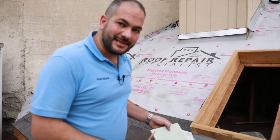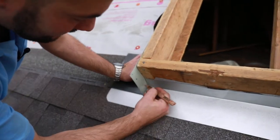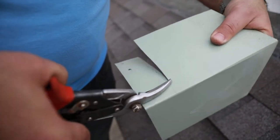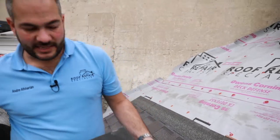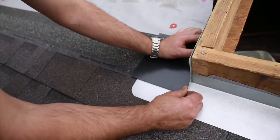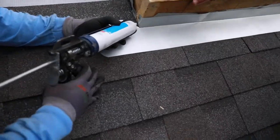The first piece of tin shingle we want to fabricate slightly to improve the flow of water. You want to bring it down past this shingle's nailing tab, make a mark, and cut it down. As always, we want to round off these corners for aesthetics and safety purposes. The purpose of this is when we install it, it's actually going to help the water flow down — we don't want water to get into this corner because this is our vulnerable corner. So when we install this first piece, we're going to install some adhesive caulking back here. Any water flowing down is going to catch this lip and flow down onto our shingle roof. So this corner we really want to protect with some adhesive caulking.